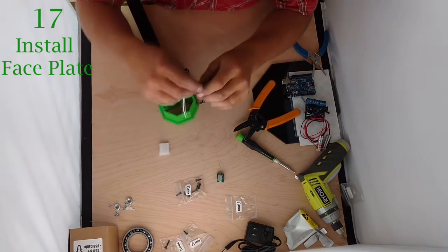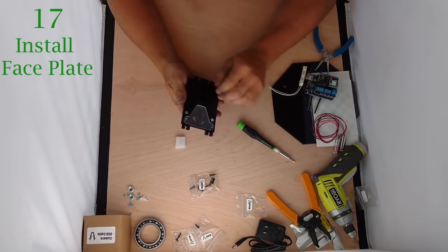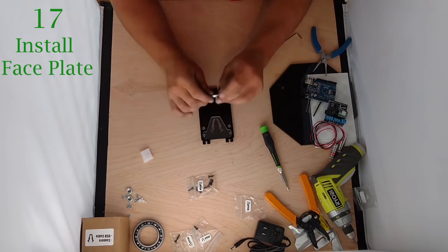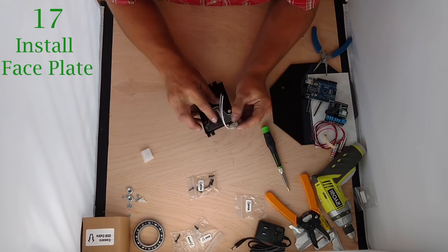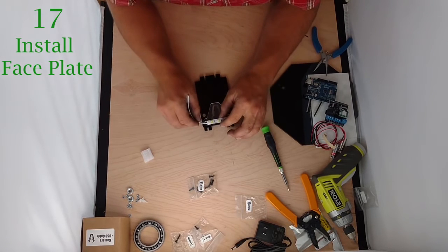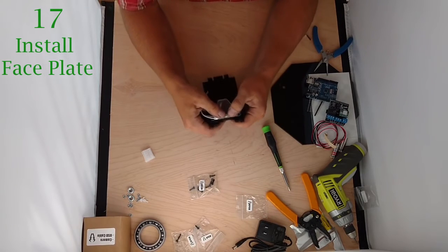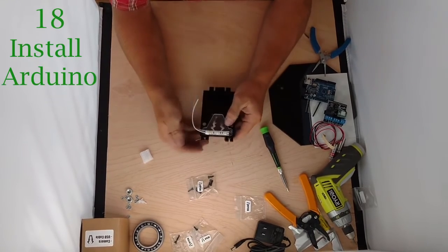I'm going to bring back our face plate — I took the liberty of removing the front plate from the scanner just to make it a little easier to see the electronics assembly in the video. First thing: take the LED, peel off the backing, and stick it so it rests just above the cow horns. You can see where the tips of those horns are — try to center it between those two nuts, which is going to be just about perfect. Press it firmly to center it down.